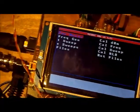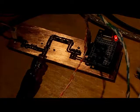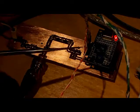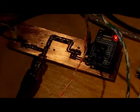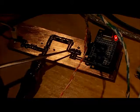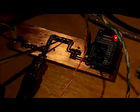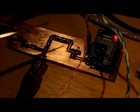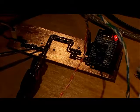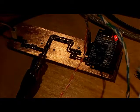There's one hardware update made to the Arduino SNA: a conditioning board was added to the AD9850 because the impedance and output from the 9850 varied quite a bit with frequency. With this board, the output from the 9850 hits a 20 dB pad (50 ohms in, 50 ohms out), followed by a low-pass filter (50 ohms in, 50 ohms out), and then a MAR6SM MMIC RF amplifier (50 ohms in, 50 ohms out), creating a stable 50-ohm signal output.